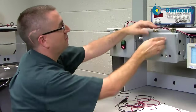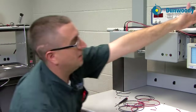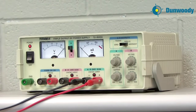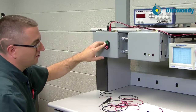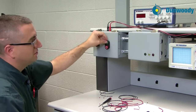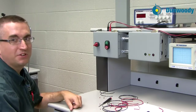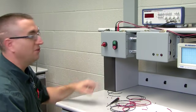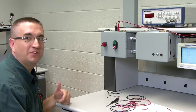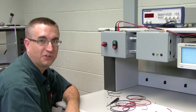At this point I'll close up the boxes. I've got my DC power source set to 24 volts DC, supplying power into this main panel. When I hit this button, if everything is working correctly, the start is going to give me my buzzer, and the stop is going to take it away. I don't have to hold start because there's a holding contact there. The stop takes it away — just as we described in the theory room. And that is a basic relay logic control circuit.